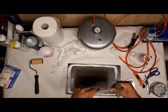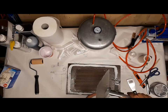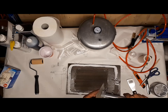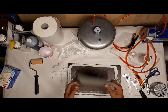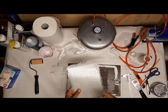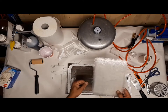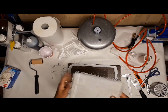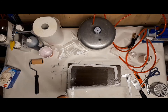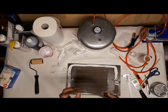Now the very thin fiberglass — twelve layers. The thickness here is 0.6 millimeters. The material I normally use is 1.6 millimeters thick. So I'll need to use a full square meter — this was only half a square meter and it gave me 0.6 millimeters, which is roughly what I expected. I'll find a use for it.